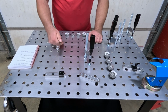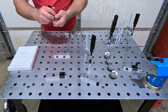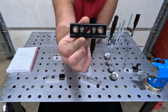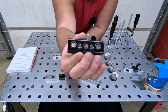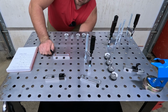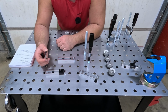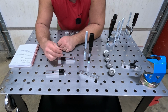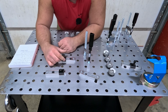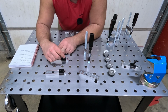The other thing you get is all these pieces here. The way they work is they have these pieces right here, okay? They have magnets in them and they're threaded. So there's magnets on the inside holes and threaded holes on the outside. The magnets go up under here and stick, and they basically convert the holes in the table into threaded holes. So you take your little jig stop here, you put these little pieces on it, and you take these bolts and put them on, okay? Then you basically have this stop, and you can position it however you want.